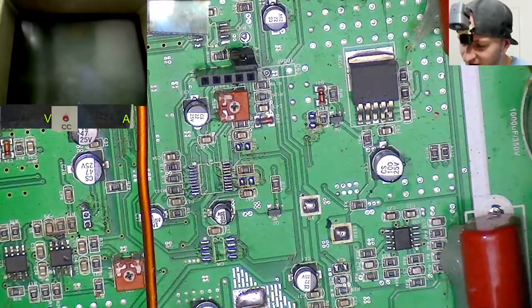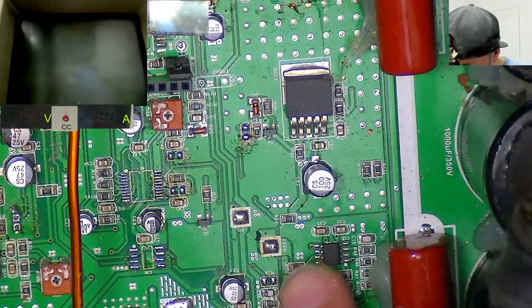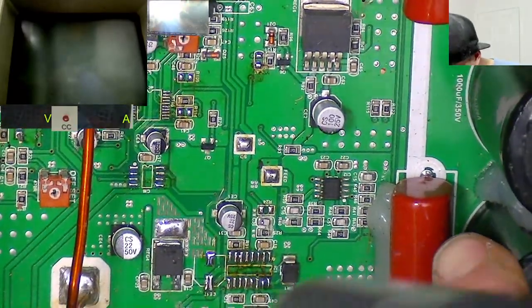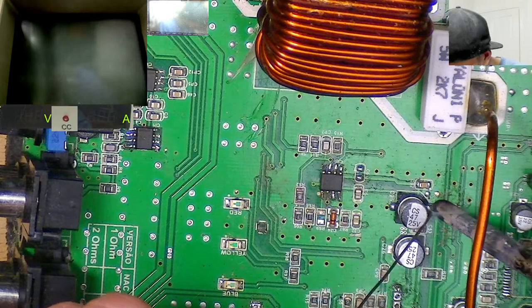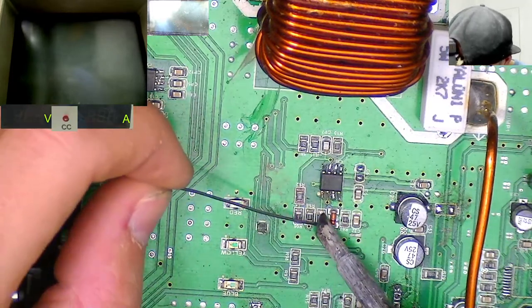Okay, anything else that the output section needs then? So, covered that resistor there, bits around here, that resistor that's missing there, I've got a capacitor missing there. That is a voltage reg, looks like that's going to be the same on the other side. Oh, there's a couple of bits and pieces over here, actually, got a resistor here by the looks of it. Probably a 4R7 going by that one there, that's probably auxiliary supply stuff. C6 might be missing.